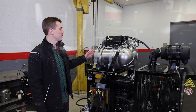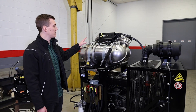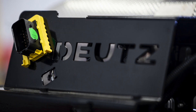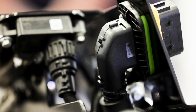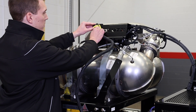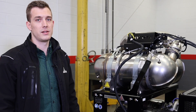All of the components that belong to the exhaust aftertreatment are pre-assembled on this plate over here. All wiring, sensors, and control units are mounted together in this bracket, and the wiring harness funnels back into this interface connection, which can then be connected to the engine with just a simple extension, just like the DEF tank. That's how easy it is to install the EAT system.